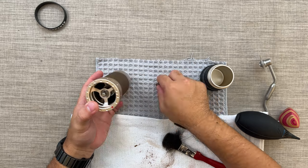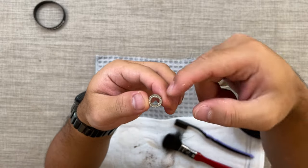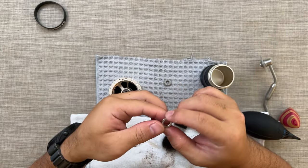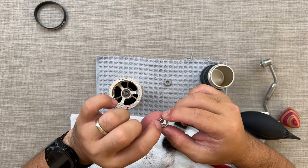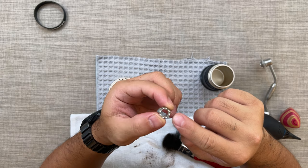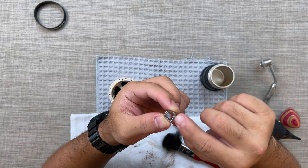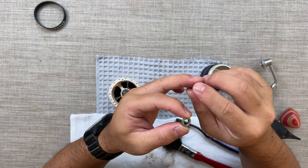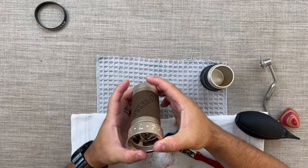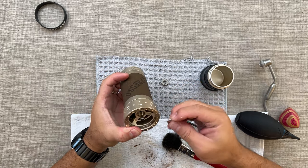For this part, you want to take note: it's rounded but it has a flat on one side — that is to stop it from turning. So you want to put that flat side onto the flat side of the axle. You also want to put the dotted side correctly — these little divots are the calibration divots for the burr and the axle. Find that flat part first, then put it into place.